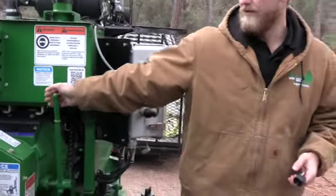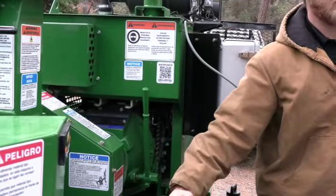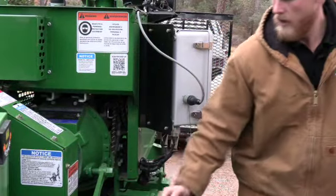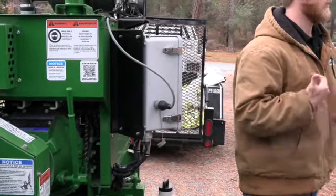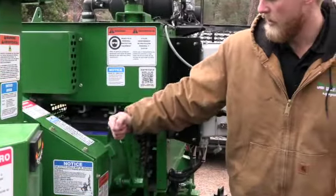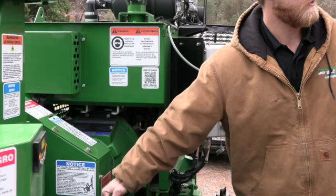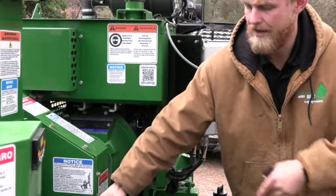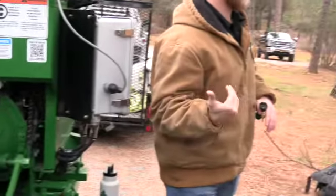This is what we refer to as a spring loaded clutch. Up is disengaged and we're dropping down into gear. Now, when I say spring loaded, when you put that handle down, it's going to want to go on its own. We're going to want to use the same engagement process as the older style clutch, what we refer to as the bump style method, where you're slowly bumping that clutch into gear. So what you want to do on this one is hold your weight back against this handle. Right about here, you're going to hear those engine RPMs start to drop as those plates start touching. You want to bump it off about 3 to 5 times to allow some inertia on that disc. Once that engine RPM stops dropping, you put that handle down, you throttle up, you start chipping.